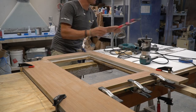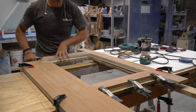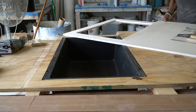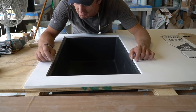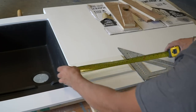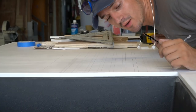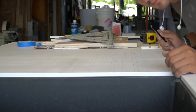It looks like I have a little bit more alignment work to do. The rough cut I did out of the plywood underlayment earlier is off by about a quarter of an inch. Not bad — looks like I need to move it over about three-sixteenths of an inch. I just drew out the drain and the dish drying rack. I'm going to route out grooves in the top so that water drains back down into the sink and doesn't just pool on the countertop. Lines up perfectly.